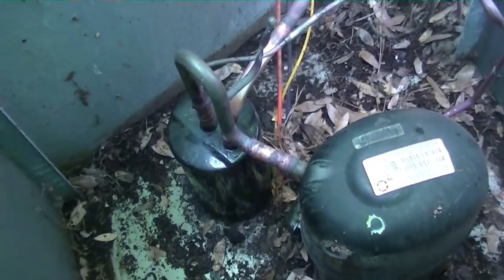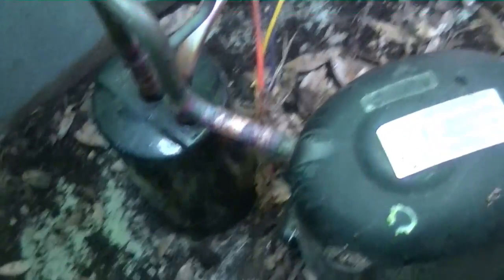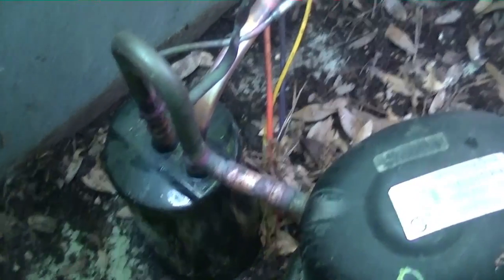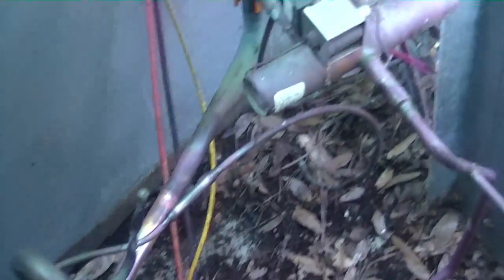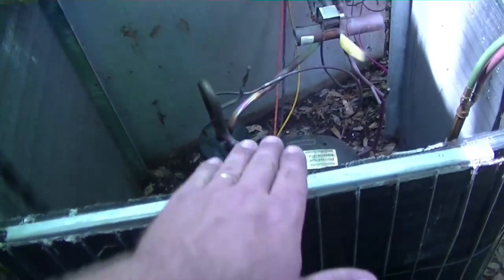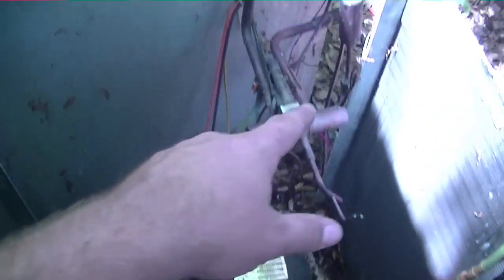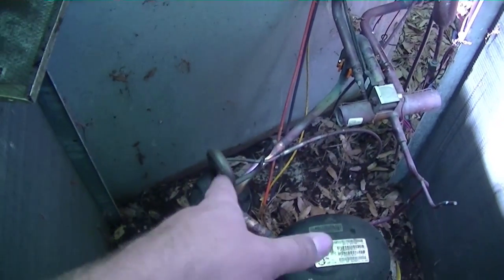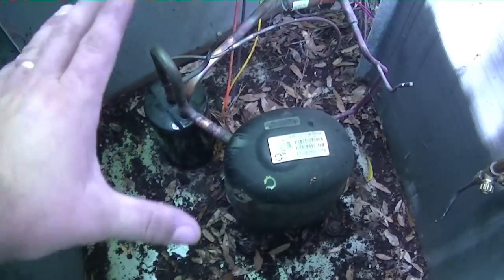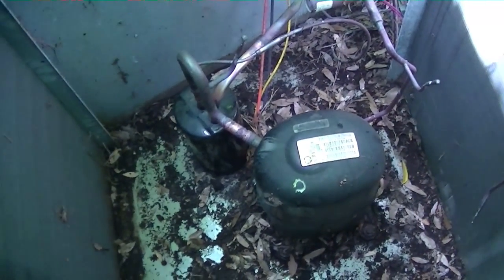Alright guys, we were all brazed up down here — had quite a few little joints to make there, but it came out successful. Had to also do a little bit of cleaning. I know it doesn't look spectacular, but there was about 3 or 4 inches of leaves in there when I started — one of the reasons why this thing probably failed. With brazing here, you've got to kind of come in from across the top of the condenser, lean over and braze most of them, and come in from the side for the rest. A little tricky sometimes, but not too bad on this one — there's a little bit of room here.